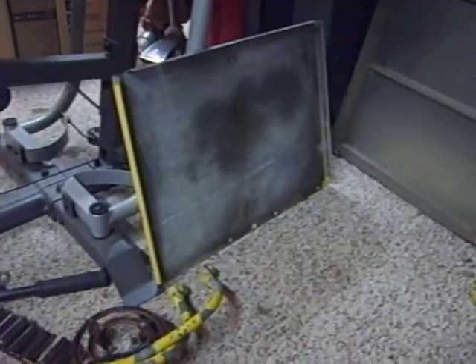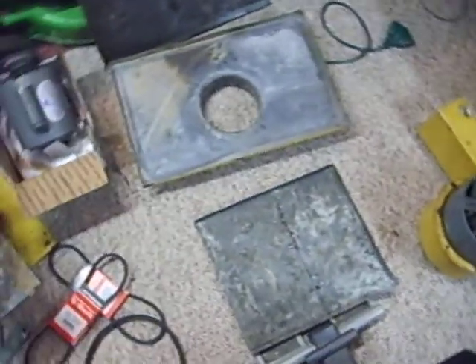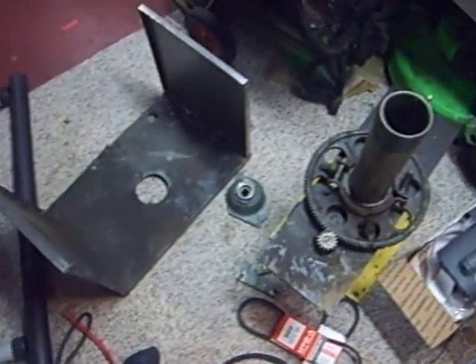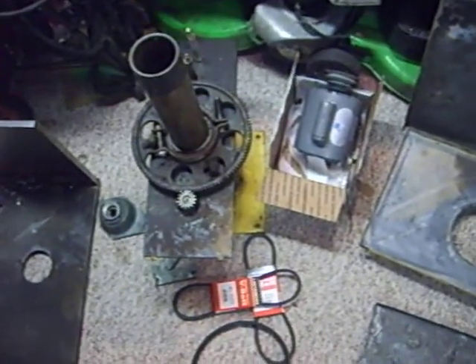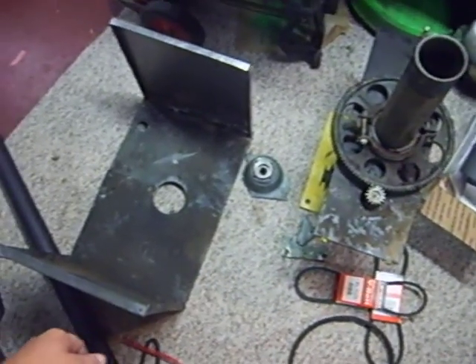That portion of the rotator box is back to how it should be — looking a lot better. That access panel is in good shape; I didn't even touch that today. This one here I hammered back pretty straight — needs a little work but really not bad compared to how it was. The top piece is in great shape now; these were all bent down and ugly-looking. Not much sheet metal work left on the rotator. Next step is going to be finishing up the welds and probably starting to strip it, getting ready for paint.